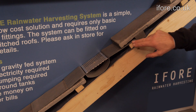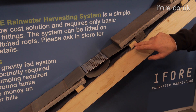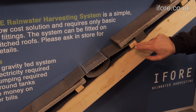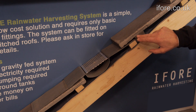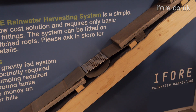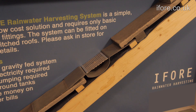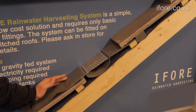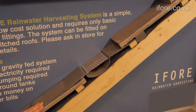In this cross section you can see how the tray fits into the roof tiles. The tray sits neatly over the top of the roof batten and underneath the tile. The tray is screwed down through the roof batten and there is a foam seal to stop any draft coming up underneath the tile.